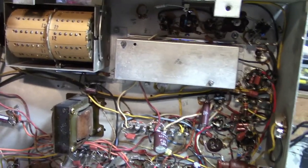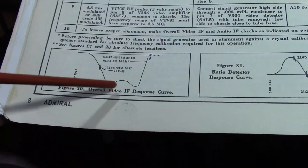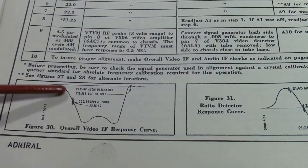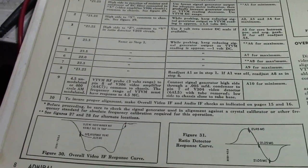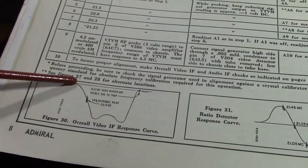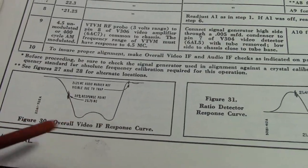That's just a difference in frequency. Then there is the matter of the IF amplifier itself and its design. It's not like an AM radio — you don't want to peak it for just a sharp response. In this set, the idealized response would be completely flat on top with a very sharp edge on one side, and this is actually supposed to be tapered. That has to do with the NTSC broadcast standard and the fact that they kind of fudge the sideband to make it easier for designers. Sharp on one side, a gradual decline on the other, and basically flat on top.